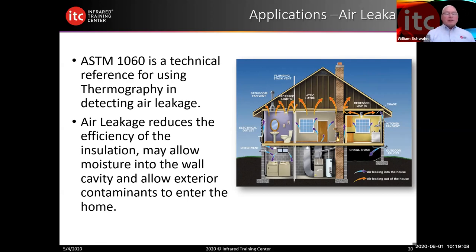Air leakage has a great impact on insulation. If I have an R19 wall and a lot of air leakage, I can cut that R19 down to R10 pretty quick. Whenever we have air movement, we also have moisture molecules moving through the structure. Those moisture molecules can deposit within the walls and bring allergens with them. Air leakage was probably one of the biggest calls I got as a home inspector with an infrared camera — people didn't want cold spots while sitting in their recliner watching TV.